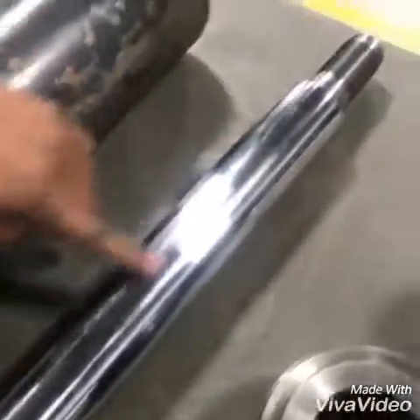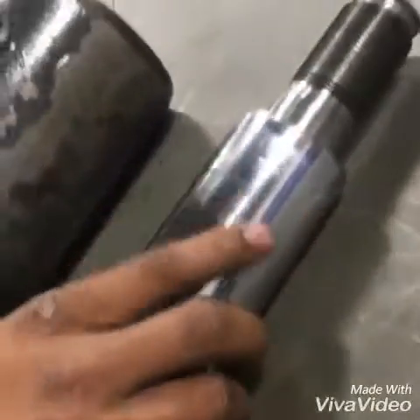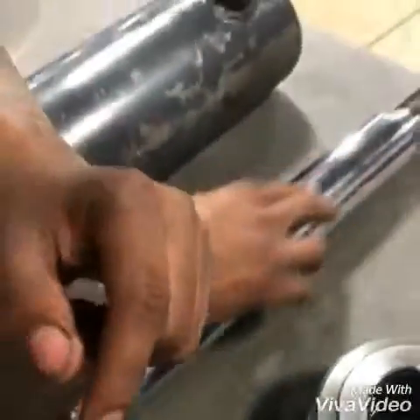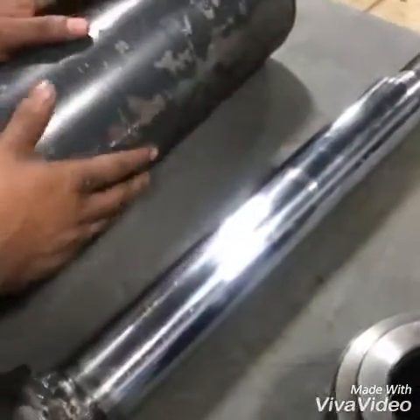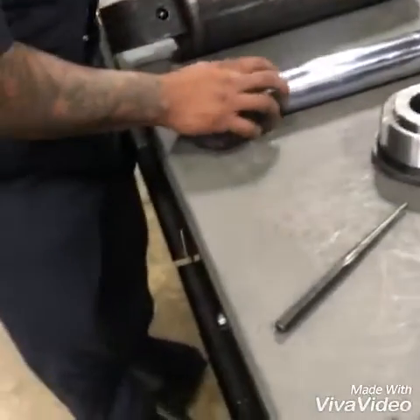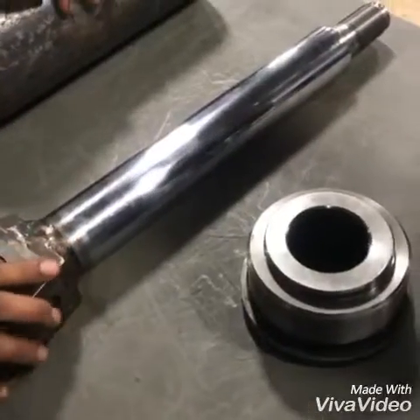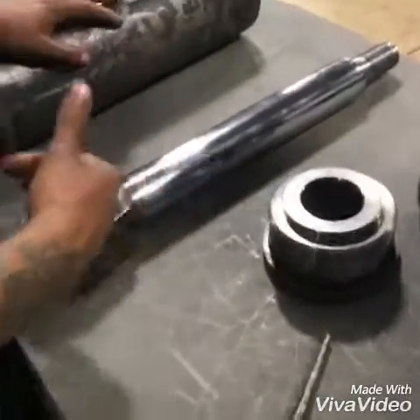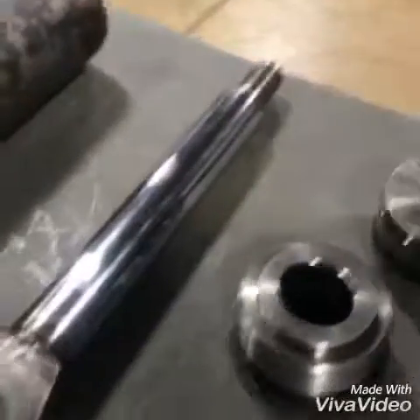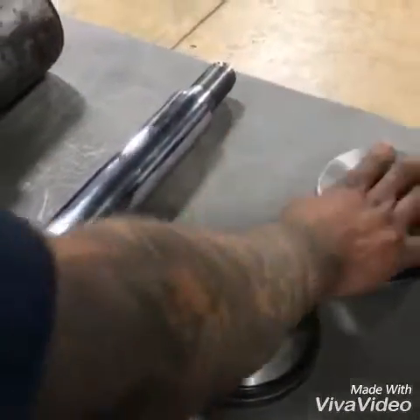Taking a look at the cylinder shaft here — on this rod, or shaft, however you want to say it — you can see it's very scarred up, a little bruised, a little nicked. You can see the wearing on it, and that lets you know it's been rubbing on the inside of the cylinder all day. You can also see heat damage from the pressure. These are the different components that go inside the cylinder — the three main components: your piston, your packing, and the shaft.